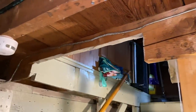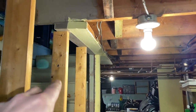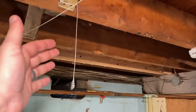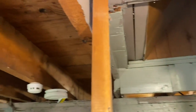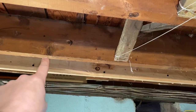My big plan is to support all these joists, rip this wall out, re-support that wall, raise it up a little bit. Depending on how bad these are bowed, I will sister them up. I'm definitely going to sister this one because it's going to be the new head height for the stairs — I'm going to cut this right out and raise up that head height because it's way too low for me. Then I'll sister that one up and raise it to where it needs to be.